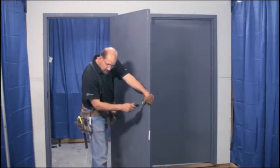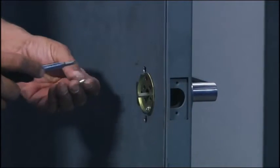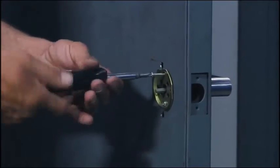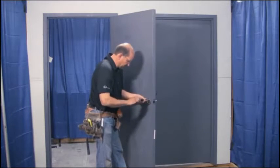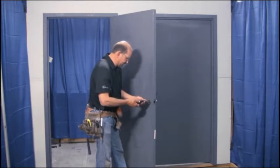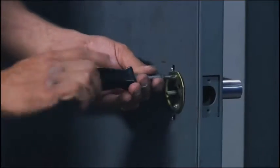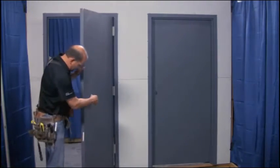Screw this one in and hold it in place, then we've got one more to put on. Screw it in nice and tight. Line the top one up and do the same thing — just screw it right in. Make sure you're going in nice and straight; you don't want to cross-thread anything. Now with the 1000 panic device and this particular trim, the two post holes will actually act as through bolts. Once we get the panic installed, we'll run through bolts from the trim into the head of the panic — it makes it a whole lot sturdier. That's another nice feature of the 1000. The key-in lever trim is on and installed.